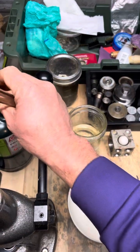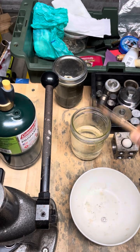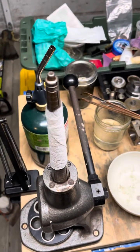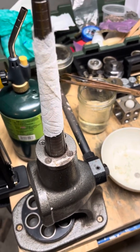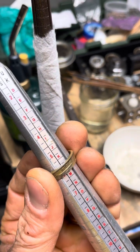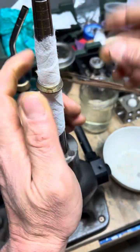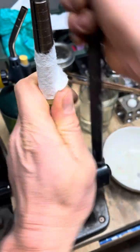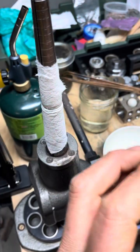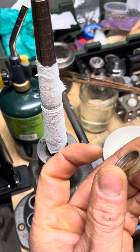Let's anneal again and then we'll start opening the coin up. We'll come over here to our ring stretcher. So we're already at a five and a half or so, almost a six. We're going to try and get this to match the stretcher and then we'll reduce it down. I won't have to go very far with this one. That's about an eight - this should be good.